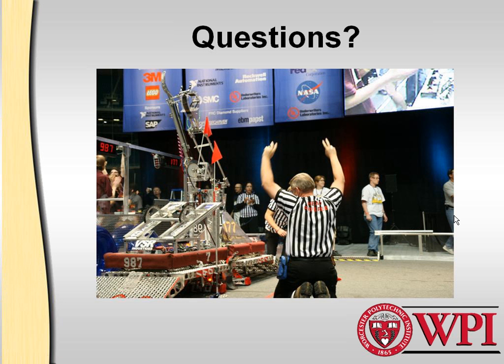Any questions? Yep. Do you have a source for the omni wheels? A lot of times the wheels get blown out. Most of our omni wheels in Team 90 have been home built, but recently we've been purchasing them. I think the ones this year were from AndyMark. The smaller your wheels, normally the more robust they are as well. The bigger wheels tend to get more side loads on them and all that. So we used AndyMark this year.